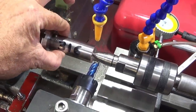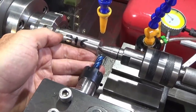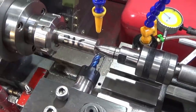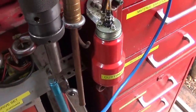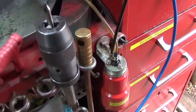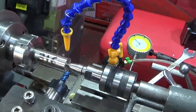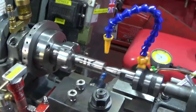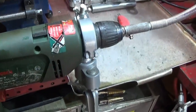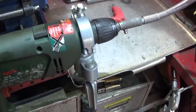I've got a piece of 316 stainless steel up in the ER40 collet chuck here and I'm using a 10mm diameter 4-flute blue nano end mill bit. I'm using my motorcycle oiler system with a trigger assembly to actually pump oil out for coolant, and I've got my Bosch drill on this drill stand here. I'll put links for all the tools I'm using in this video below.